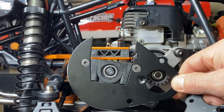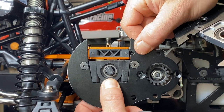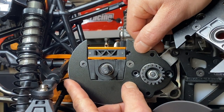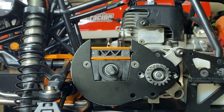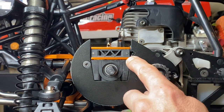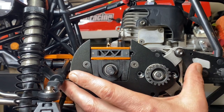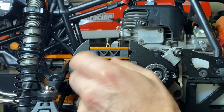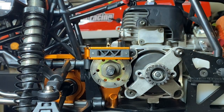Well, this stock plate — if you notice when I put it on — it's hitting the gear a little bit. When I go to slide it on, it wants to hit the gear. I need to finagle it to get it on. And if you notice, see the gap here that it's leaving? The inconsistencies in this plastic piece sometimes cause an issue. Sure, I could shim it maybe, but I don't want to because I don't like how it fits over here as well. So this plate, when I put it on, it caused a bind — I could feel a hindrance. I couldn't use it.